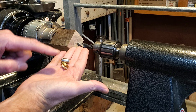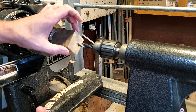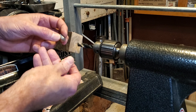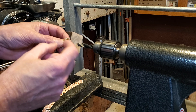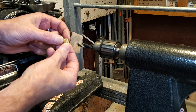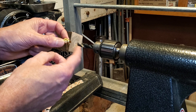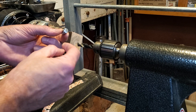In this video I'm going to go over how I put the threaded inserts into the blanks. So here's a bottle stopper blank — I'm going to drill down into it. These are the threaded inserts: this is the brass one, it goes all the way through. These are used for doing pizza handles, ice cream scoop handles, where the tine is longer than the bottle stoppers.